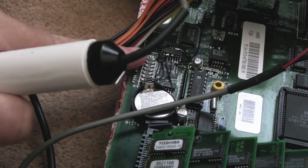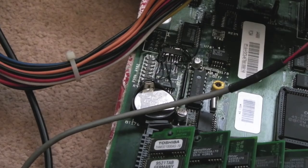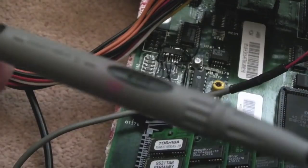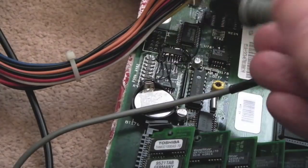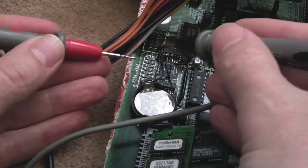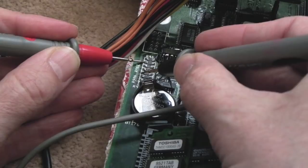And I traced it to this block of resistors here using PCB Explorer, actually. Such a good website, that, it really is. And switch it off, just test continuity. I knew these were a block of pull-ups right at the start here before I did the modification work around here. What I didn't realise is these are all joined up, look, on this side here.